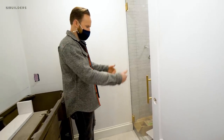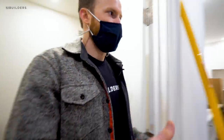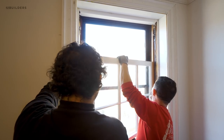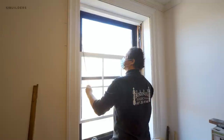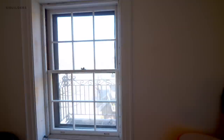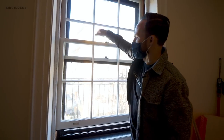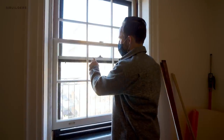It's not an ideal situation pitching the shower back to the linear drain, but we're working with existing conditions. We had to make the best of the scenario. Big day, because for weeks now we've been locked in here with no natural light, and we've actually got our windows back. These went out to a window restoration company. These are the original windows with original glass that were restored. They've cleaned up a lot of the old existing finish and brushed on a new finish - they're not looking to make this super refined and brand new looking, just clean it up and get some of the detailing back. All the hardware has been replaced with antique brass. If I lift this up, there's a double-hung window - they've added a rubber bubble seal. You're not going to be able to see that just because it is on the outside, but that way you're getting this connection to the upper sash.